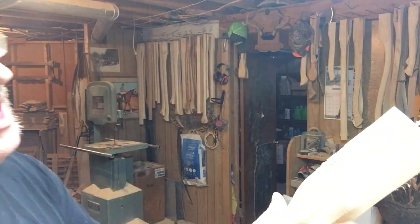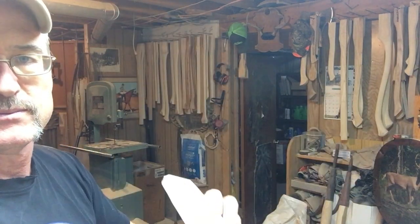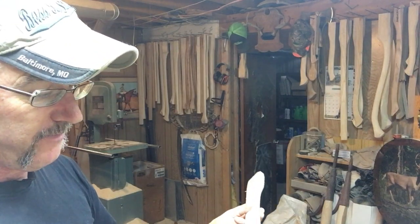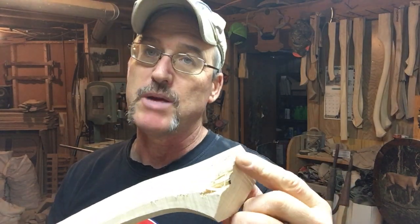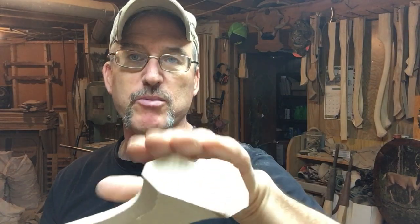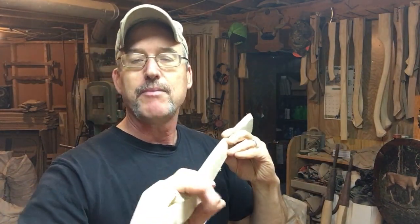This one here — I thought I could get around this split up near the eye. If I was going to hang it on a little bit smaller axe you can get around that little bit of damage in the handle because the rest of it is good hickory. There's also a little bit down here. If you have a handle like this it's actually not the end of the world because your hand goes here — not near the damage. Even though it looks bad it won't go to number one, but when I do my bevel on the bottom and shape it a bit more I can get rid of almost all of that. It's still a good handle for a little bit smaller axe head.